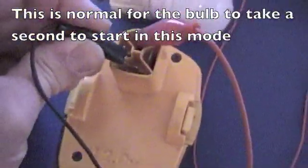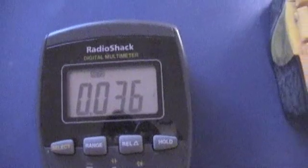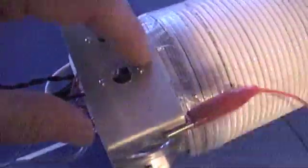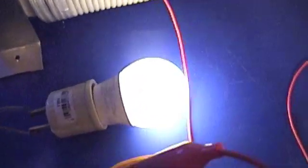Here's this Philips bulb. I've got an amp meter and a 12 volt supply. It's pulling 36 milliamps with no transistor. That's the dim setting — there's a little switch here that cuts out one of the high voltage coils, so now I'm running at 13 milliamps and it is blinking. That runs at about 89 hertz consistently.